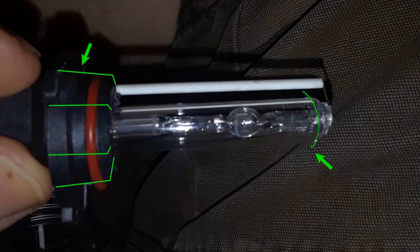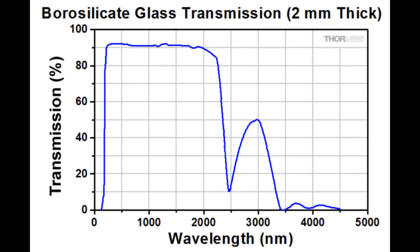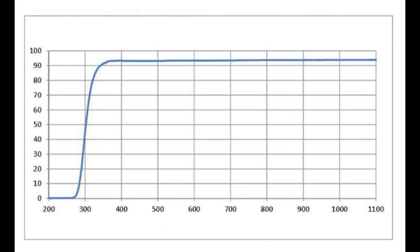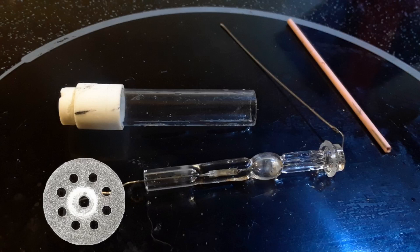The quartz HID lamp capsule sits inside of a borosilicate envelope whose purpose is to filter the UV output, and to contain the quartz capsule should it explode in operation. The borosilicate glass may be doped with other materials, because plain borosilicate actually transmits a significant amount of UV, and the envelope blocks most of the UV being emitted from the capsule. Also, the envelope fluoresces a rather bright sky blue color. The bulb must be cut free from the holder and the envelope removed. This is done with a Dremel cutting wheel and diamond disc. The bulbs I've encountered are only fused at one end.